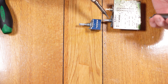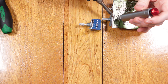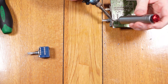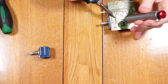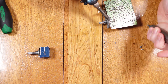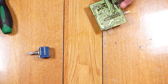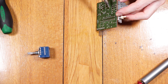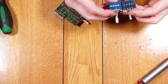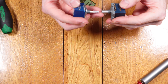I'm now going to remove the original potentiometer using the soldering iron and the solder sucker tool to free the unit. I always find the solder sucker tool removes the solder much more efficiently and it's ideal for this type of job. Now that all the solder is removed and the unit is free, we can pull it off the circuit board — just take care that there's no solder still joining that could potentially cause damage when you pull it off.